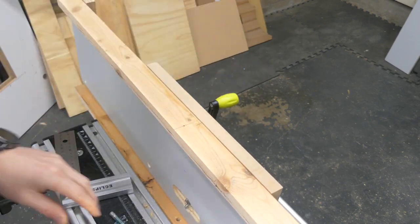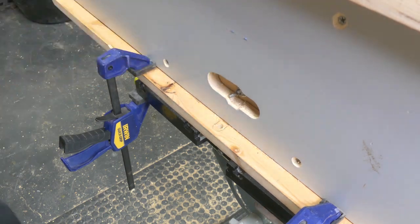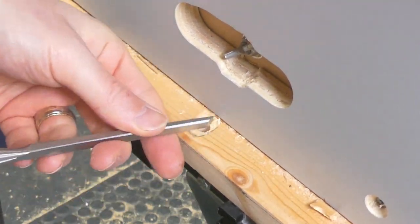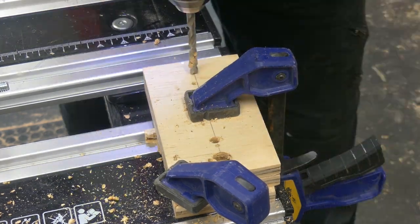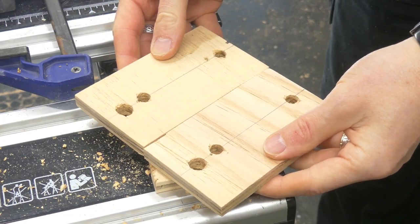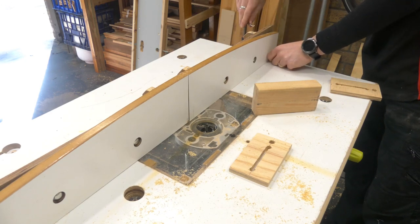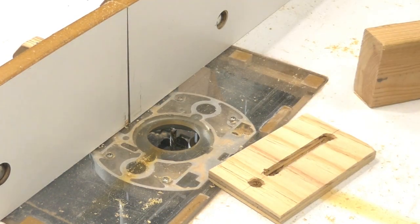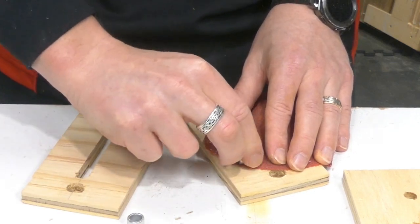Now it was time to drill the mounting holes in the actual router sled. And again, these are going to be held in place with T-bolts, so I had to chisel away a little piece of the sled. Next up were the plates that will hold the drum to the sled — one hole down the bottom for the mount, and those two upper holes are going to be connected to form a slot. I did this on the router table though there are many different ways you could do it. Do be careful when doing these plunge cuts on the router table — it can be a little bit hairy. As long as these were the same length I was going to be happy; they don't have to be super clean. I probably didn't really need a guide bushing down the bottom but I made one anyway — same procedure: drill out, ream the hole, sandpaper everything for a bit of grip on the glue, and then tap in those bushings.